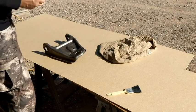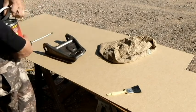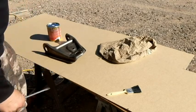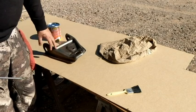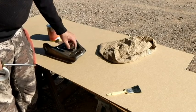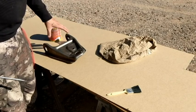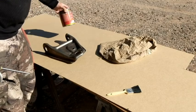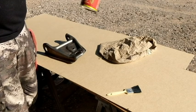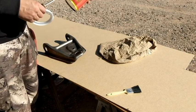What do they got going on with this thing? Now, I'm just gonna be tough with it, I guess. Anyways, I'd gone over it with the wire brush and brake cleaner, which left kind of a greasy film on it. So I want to get it with the brake cleaner one time, and then wipe it down with the acetone, and then she'll be ready to paint with the Por-15 rust preventative permanent coating. They've got a treatment too, but this seals rust permanently.